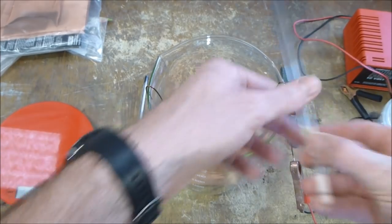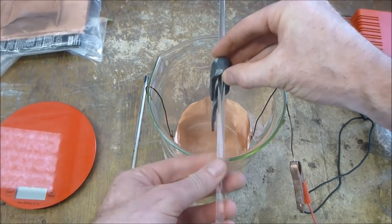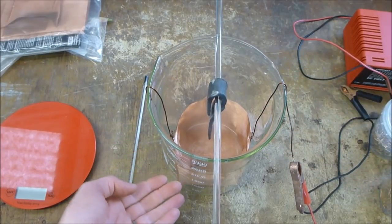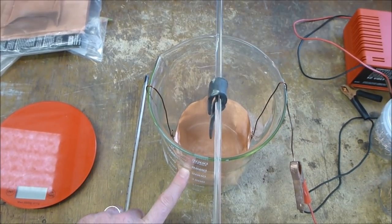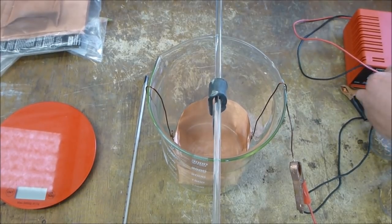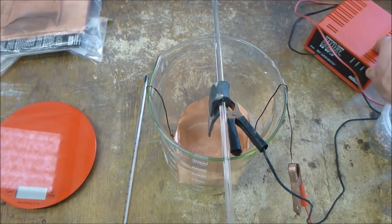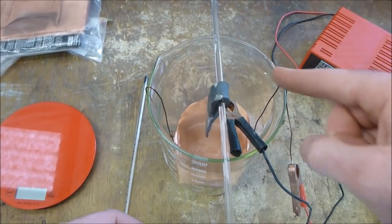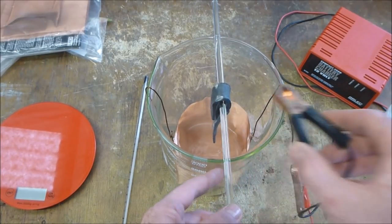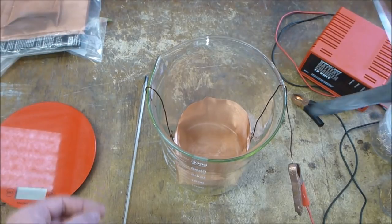The idea is I've got my lead cathode — the negative electrode — and I'll put that in there. I'll fill up the basket with pins, probably half a basket at a time. The sulfuric acid will come up to about that level on the lead cathode. I'll connect the negative and the deplating will happen. I'll use the battery charger as a power source with my multimeter on the current range in series, so I can see when the deplating is finished — indicated by the current dropping.